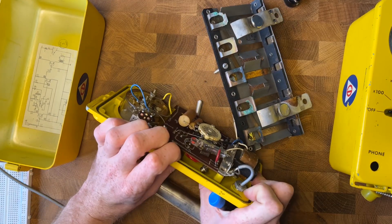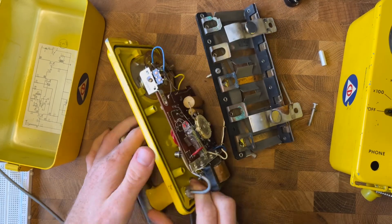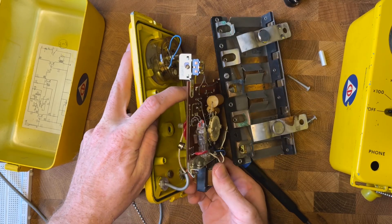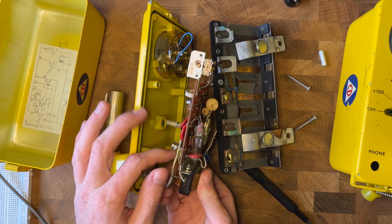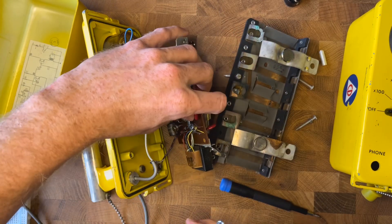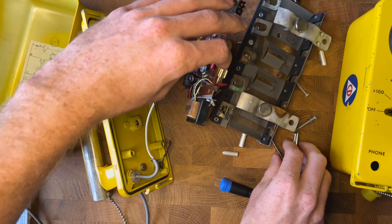Now we should be able to start working the board out. I'm just pushing on the shaft there and you can see it's popped out. Be careful — there are some glass components in here, some fragile stuff. Just wiggle it out back and forth. You can see now that we have some wires connected still. We're going to disconnect the gauge wire and there's also a speaker wire here. Go ahead and cut the speaker wire. There are all your internals — set those to the side.